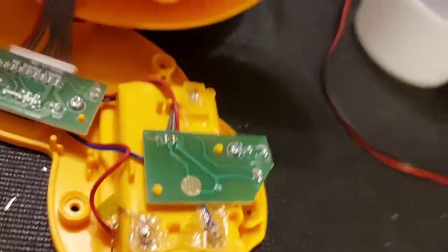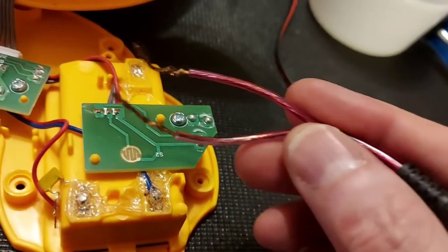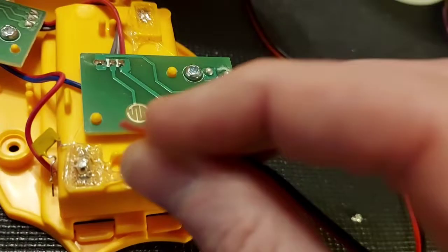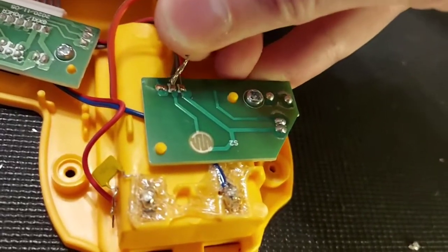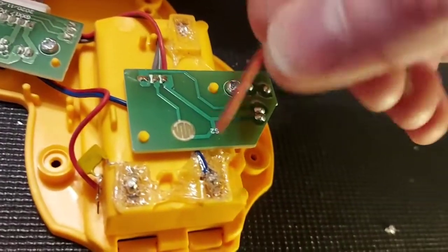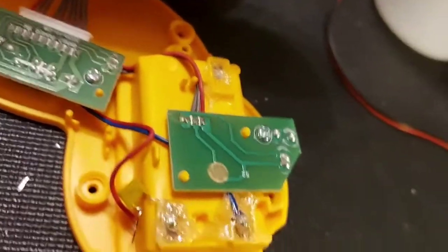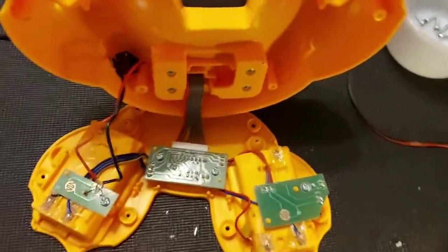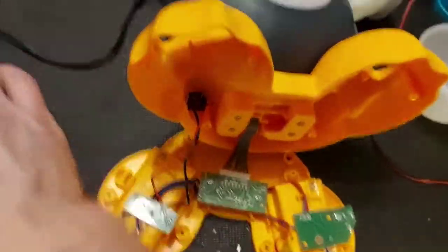I would recommend the center plus the right one. Here's another example of some wire with stripped ends — you furl it up in your fingers, spin it around, make it nice and neat and clean. All you're going to do is solder one strand to the center and one strand to the outside on the right — one strand each. That will activate your other switch, which on this toy looks like it's about shapes and numbers. You don't have to adapt both, obviously. But if you'd like both options or some variety, plugging into one side gives you music, and plugging into the other gives you shapes and numbers.